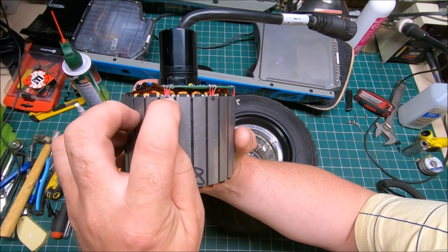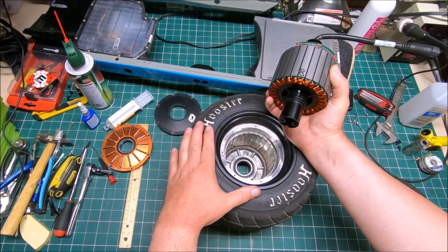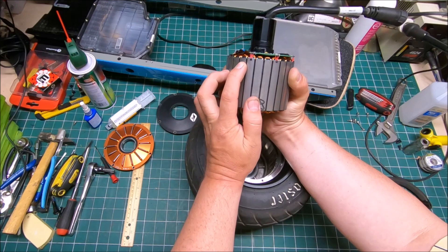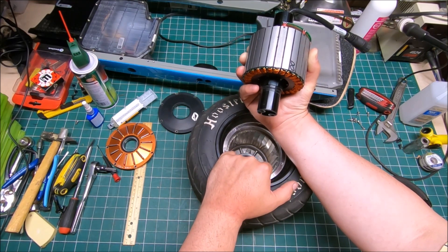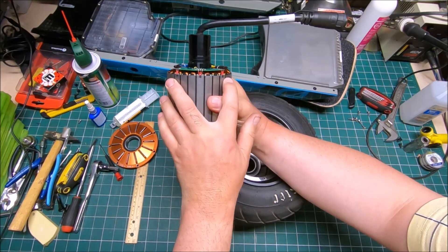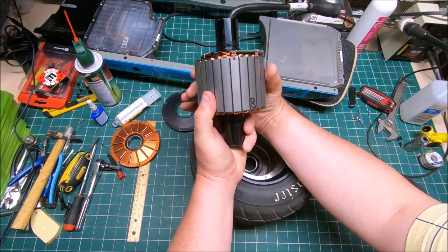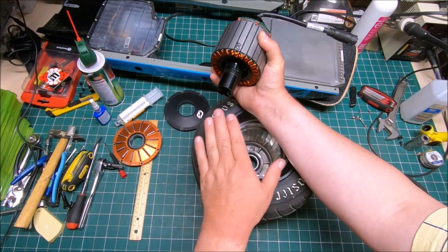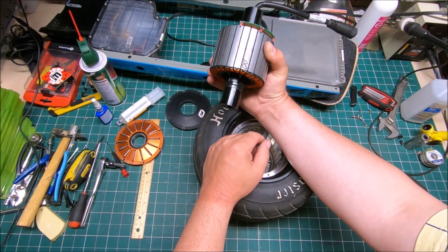Cogging is usually caused by hall sensors. When I put it in the XR housing hub, I recognized that the magnet sits slightly lower than on the GT. That's understandable — all those hubs are probably not identical; some will have the magnet slightly higher, some lower. At first glance the sensors all looked fine, the way they should be. That's when I started doing research to find out what was going on. I even swapped back to the GT hub to see if the problem would occur — no, the GT hub worked fine. I switched back to the XR hub and the problem was still there.